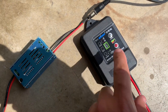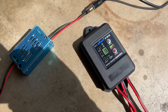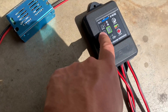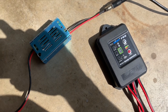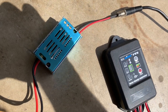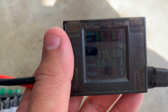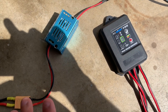No matter how you slice it, the DC-to-DC is more efficient than the solar charge controller. I'm not sure exactly why. To keep this project safe and proper we're going to lose about 10 watts of efficiency — which isn't a lot. And of course this is PWM, so it's not a true maximum power point tracking mode like the better controllers use. This one is hitting 100 watts.